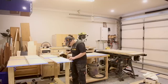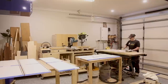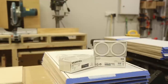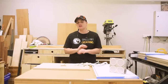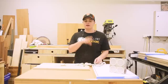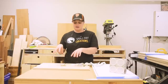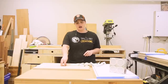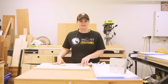To help the Lego cars look like they're in showrooms, I painted the inside of the boxes white. The last step before glue-up is to install the lights. I've gone with cabinet lighting from IKEA — I'll leave a link in the description. I chose these for two reasons: you don't need to be an electrician to install them, and you can plug up to six lights into one power pack, so you only have one cable running from the boxes to the wall, keeping everything neat and tidy. You can simply double-sided tape them to the plywood, but I'm going to countersink mine through the plywood and route a groove out the back for the cable. I did this on my test piece first to make sure everything was right.